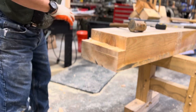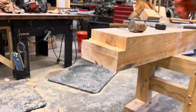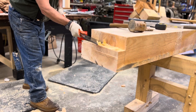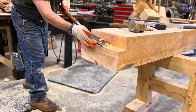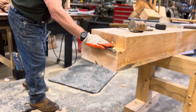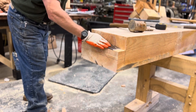Now we've got it roughed out in pretty good shape. I'm going to get the slick chisel. This is the slick chisel, and it really works like a hand plane. It's fast, and you keep this bottom portion on your work surface — it keeps your cutting with this chisel very level with the surface that you're trying to maintain.